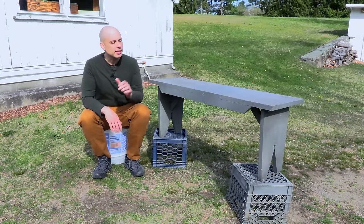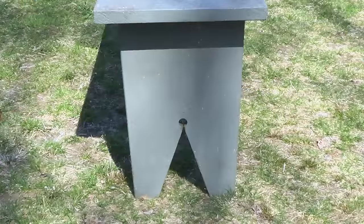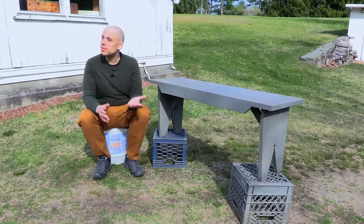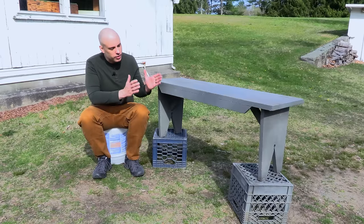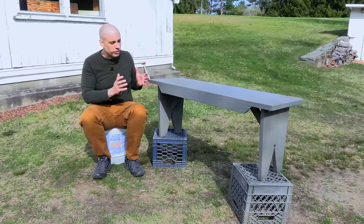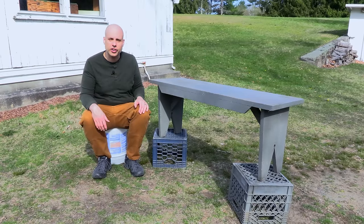The thing that surprises me the most is that the legs are angled — they angle in towards the bottom, narrower at the bottom than the top. I would never in a million years think to do that; when I'm making seating, I try to get the legs as wide as possible for stability. But this bench is plenty stable, and having that little bit of narrowing gives the whole thing a lightness, a sense of uplift.